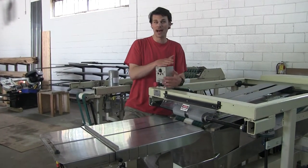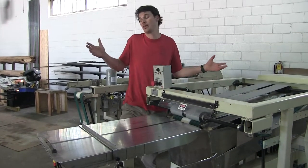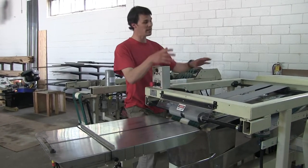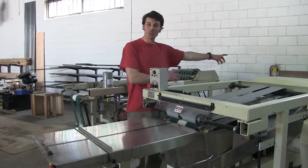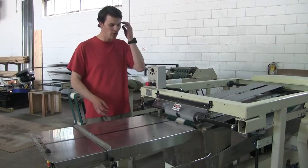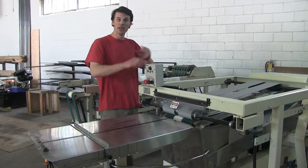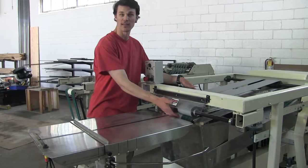Since you've got the 4200, I'd say run it at around 90 — even 100 PSI is not going to hurt a thing. That way we guarantee we get enough air pressure to make the entire machine work and function correctly. Once we've verified we have at least 80 PSI — and between 90 and 100 is the golden number — go ahead and push the e-stop button, which cuts all power and air off the machine, and we're going to start adjusting this gap.